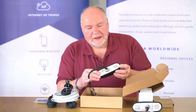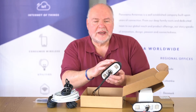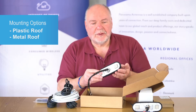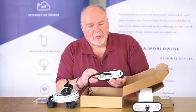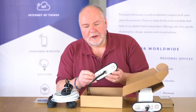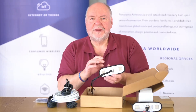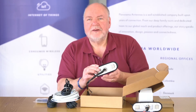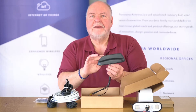One of the features of the Sharky range, especially if we're not using it with a comms whip, is that we can mount this antenna on a metal or a plastic roof. If mounting on a metal roof, the antenna incorporates capacitive couple pads which make better contact with the ground plane. The antenna fits with a single hole in the roof, so we only need one hole mount. The antenna is IP66 rated and we can supply it with a white cover or a black cover.